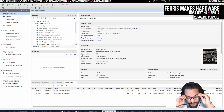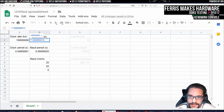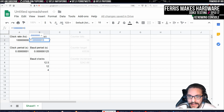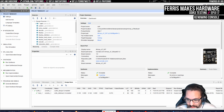If we're able to get this rate better like this, then we'll end up with a lot of jitter. But I guess the rate itself would be okay, because I'm thinking 4 times this, or even just 2 times this. Now it's 12.5 clocks. So if that were sometimes 12 clocks and sometimes 13 clocks, half one, half the other, then the rate ends up being the same on average. So I think that would still probably work. Especially because the reason why the receiver super samples like this is just in case there are some of these small rate changes anyway. The receiver has to be a bit more robust to these kinds of errors.